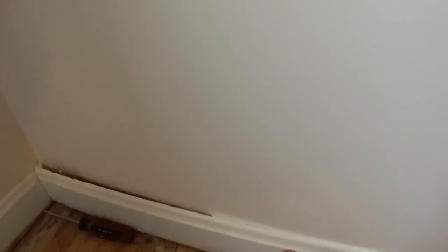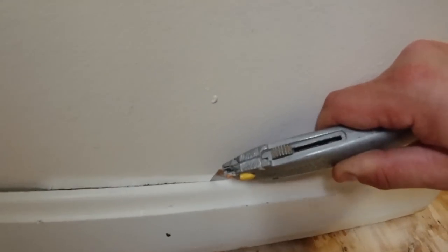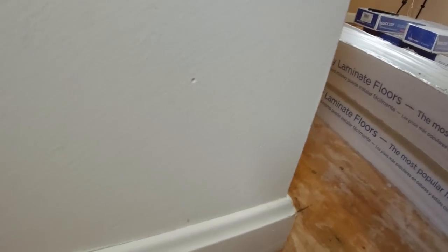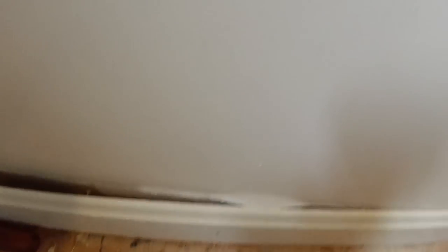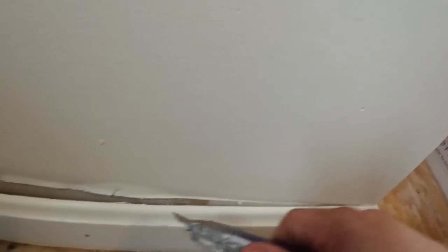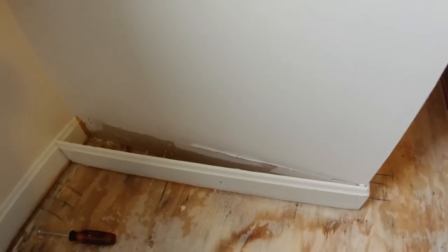So you can go along the top here and cut through the old paint and the old caulking just so you don't mess up the wall too much. Remember, with new flooring here it's going to raise the baseboard so it'll cover this a little bit. And then you can peel the baseboard off — see, that's where you have to cut it. Try and cut all that caulking and paint off so you can avoid that. You can carefully take these pieces off and reuse them.